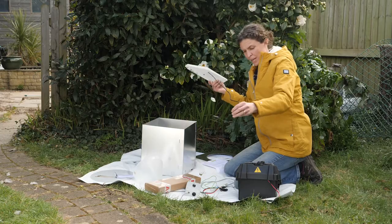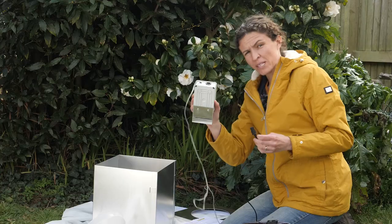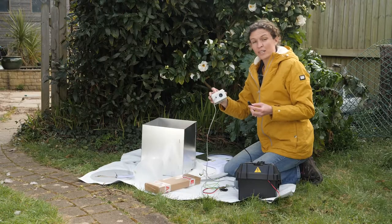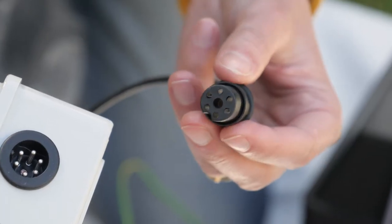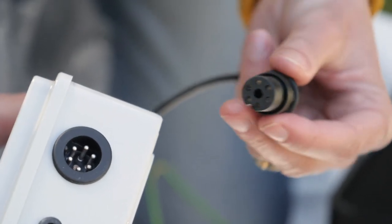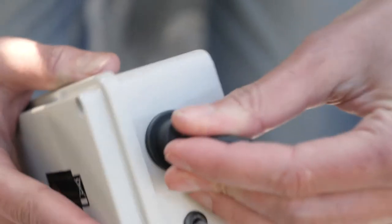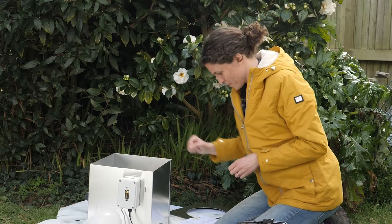And the black cable that comes out from that, we need to plug into the bottom of the ballast box. Now this is the ballast box, it's got all the electronics for the moth trap in it, including a little sensor that means that it comes on at dusk and turns off at dawn. And the plug has a little divot in it, so you can only put it in one particular way. And just push that in nice and firm and then slide it onto the side of the box.